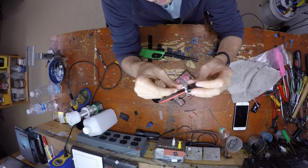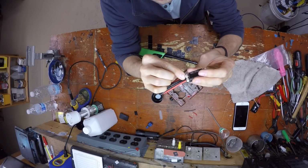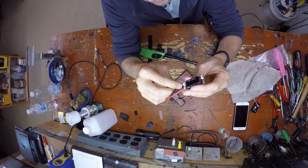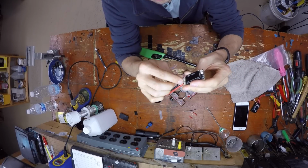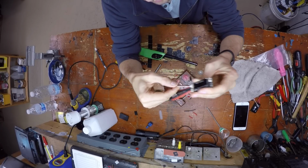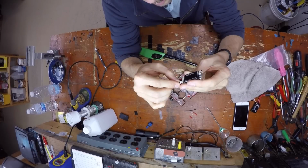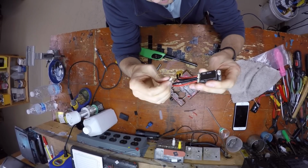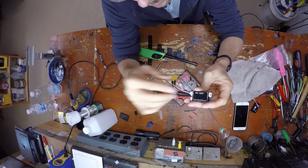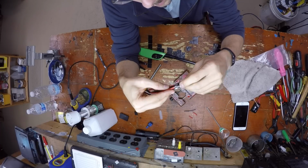It will plug into the 4-pin, and it's actually tighter than the 4-pin because the little dowel pluggy things don't line up correctly. But the downside to this is if you plug it in wrong, you could potentially damage your camera. So I recommend finding a 4-pin and actually pulling one of the wires out of it and just running 3 to the camera. But it comes with a 3-pin, and it's meant for the RSSI port, but a lot of people don't run RSSI, including myself, on these really simple mini quad builds. So yeah, I'll just run the 3-pin into the 4. If you want to be super anal about it, you can hot glue it, and I haven't had one break. So yep, cool.